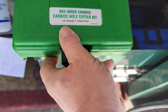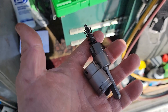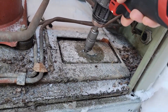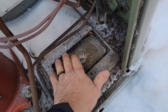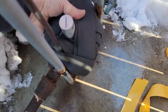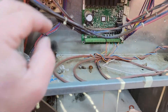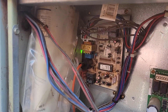I love these Greenlee quick-change carbide bits — you can switch the heads out and it drills right through that nasty thick stuff. We'll drill a hole through the bottom and run a Romex connector up through there — you really should use two hands. That bit's designed to keep you from going into an electrical panel and hitting wires. So we ran a Romex connector through there and brought a wire up through the bottom. Put some duct tape first, then insulation tape, and duct tape around it again to keep it protected and seal those holes to keep the heat in. I reset it once and it did not take off — let's see if the insulation tape has helped in keeping the heat in to get it going.